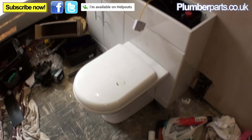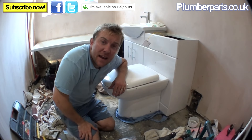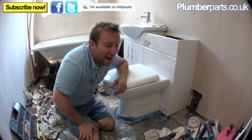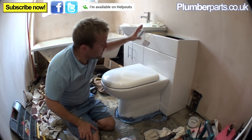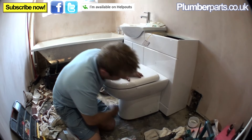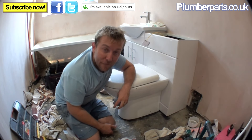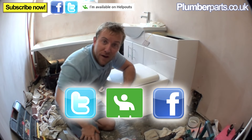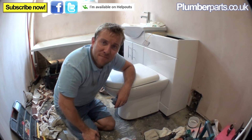It's a good idea now to turn the water on and just test out everything before you seal everything up. So I've got the loo in — I have to take it out again because that little back bit had a little bit of a leak, but that happens to the best of us. All I need to do now is drill a little hole through here to take my nice little button, pop the lid back on, then seal up around the bottom and put the little screws in around there as well. I hope you've enjoyed this Plumberparts.co.uk video — it's given you a better idea about how concealed toilet systems work and how easy they are to fit. Visit our website at Plumberparts.co.uk, subscribe to our videos, follow us on Twitter and Facebook.